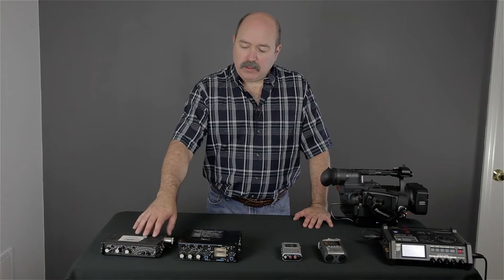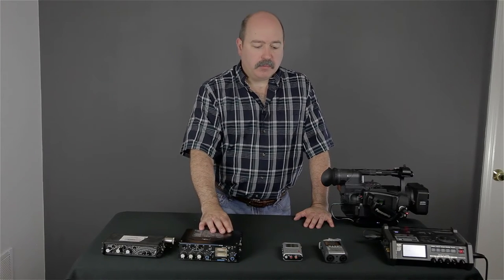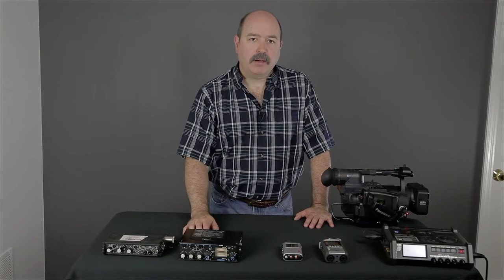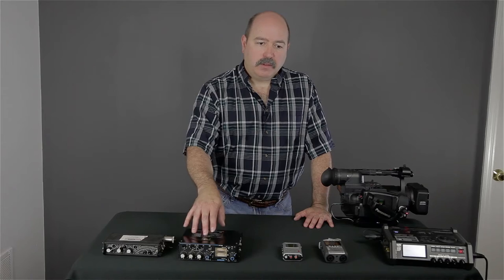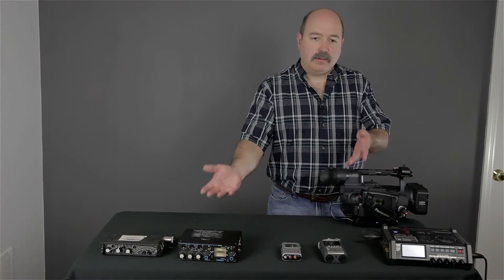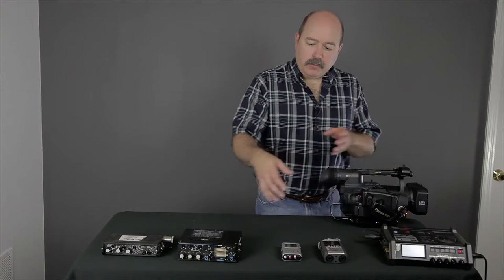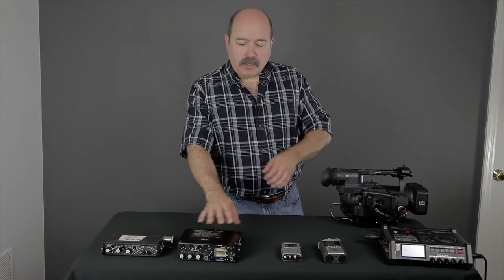The mixer is the thing that's in between the microphone and the recorder. You don't always need to use a mixer — sometimes they're built into a recorder or the camera. It's good to have a mixer if you have a separate audio person on site, because they can control the audio from all the sources and send it to the destination. For instance, if you're hooked directly into a camera and you have an audio person without a mixer, they can't turn down the levels if something's too loud. So you have separate control — the camera operator worries about camera functions, and the audio person worries about audio functions.